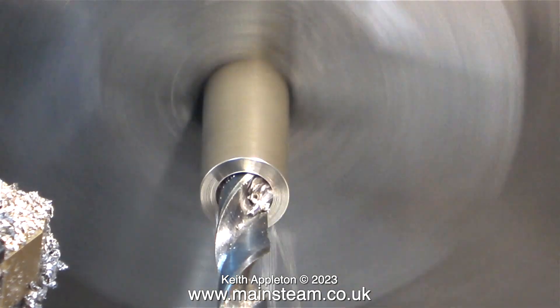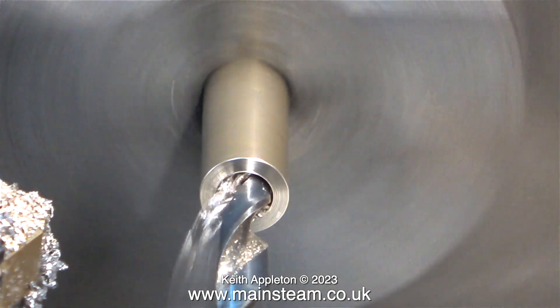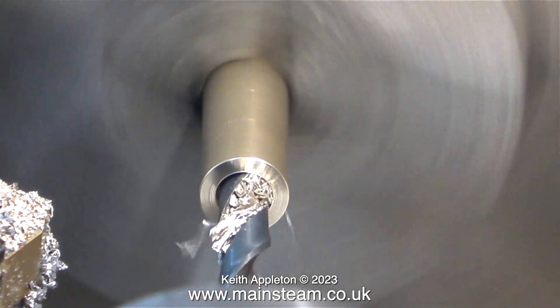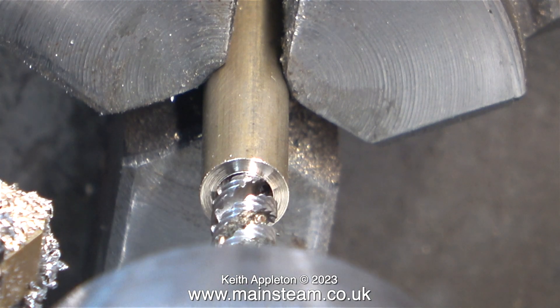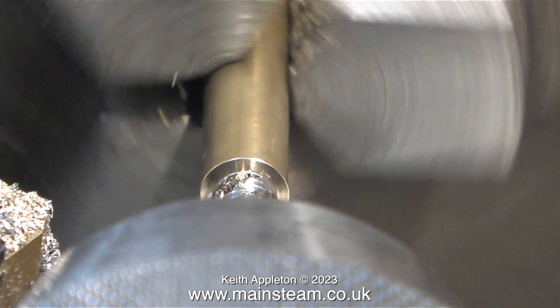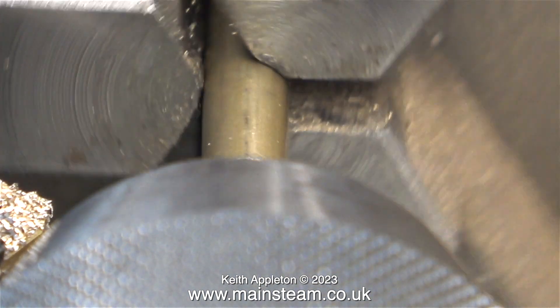This clip shows me drilling a hole in the centre of the work using a 5/32nds of an inch diameter drill. Why 5/32nds? It's because it's tapping size for 2BA, and this needs to be threaded 2BA to take a bolt from underneath the baseboard. After drilling, I'm threading the hole 2BA using a 2BA spiral tap. These function a little bit like a twist drill and clear the swarf a bit better.